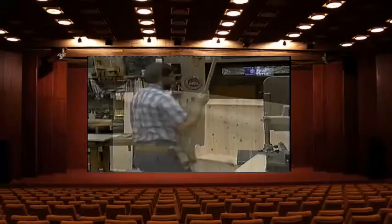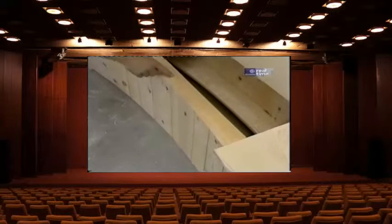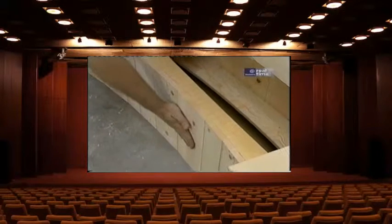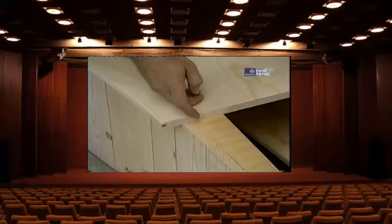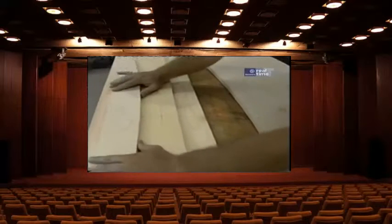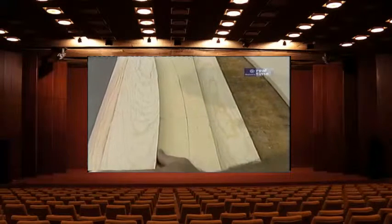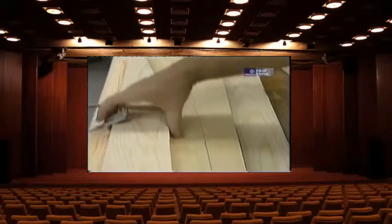Now I've got to make a piece that's 4 inches wide. That takes care of all the curved pieces I need for the back of the bench. For the front of the bench, there are two pieces — one at the top and one at the bottom to which I fasten the boards. The radius is different because it's in 2 and 3/4 inches, so I'll use the salvage from my front cutout of the seat. I've fastened a couple boards together for the top and bottom cleat, set the salvage on the board, and using a compass set to 2 and 3/16 inches — the difference of that radius — I'll lay it out and cut both boards at once.